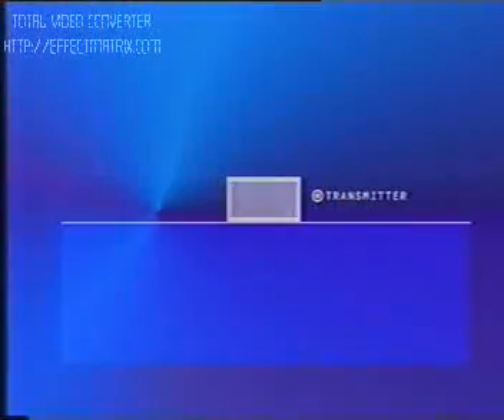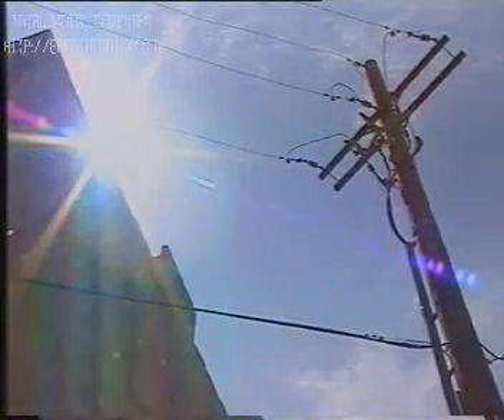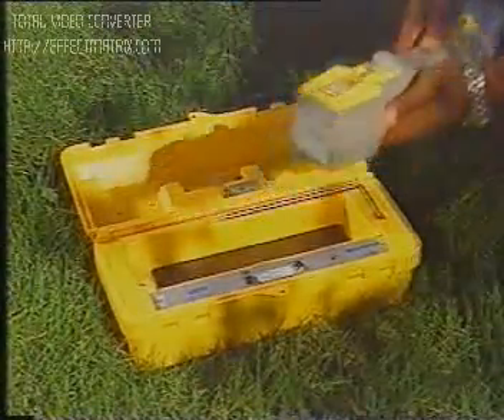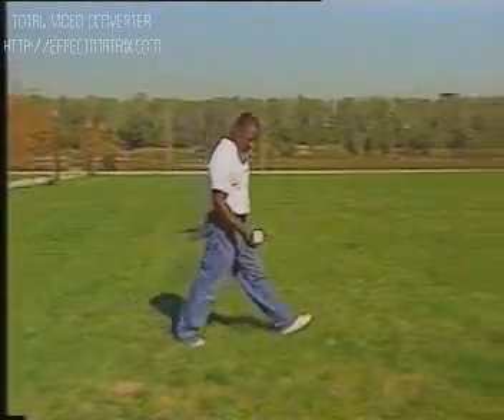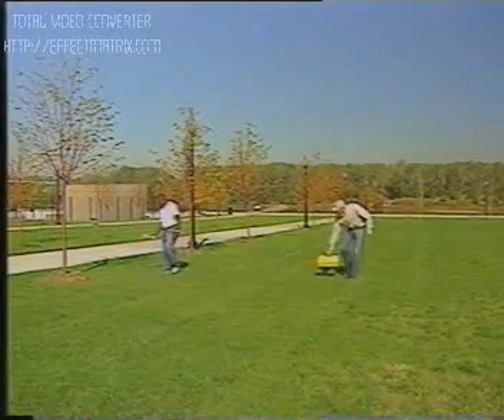Transmitter induction will induce both below and above the transmitter — be cautious of interference from buried cables and overhead lines. You can also use transmitter induction to do a sweep. One person holds the transmitter and another holds the receiver. By moving together across an area, rotating each pass 45 degrees, you can sweep an area to locate cables and pipes.